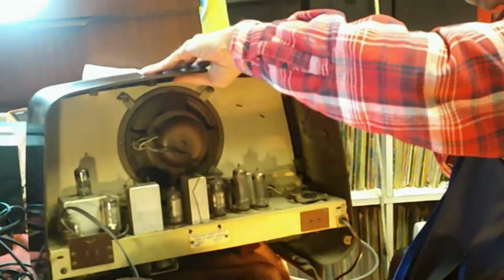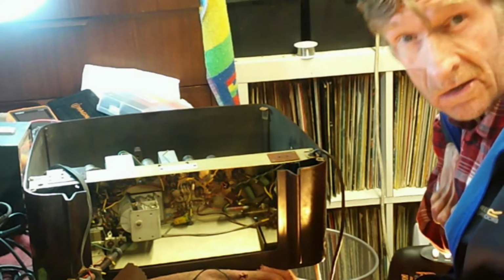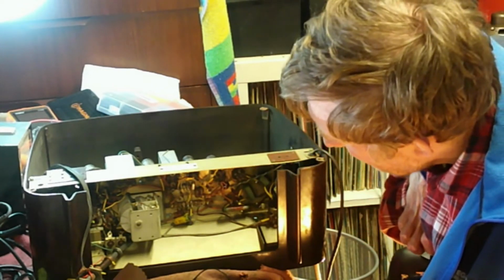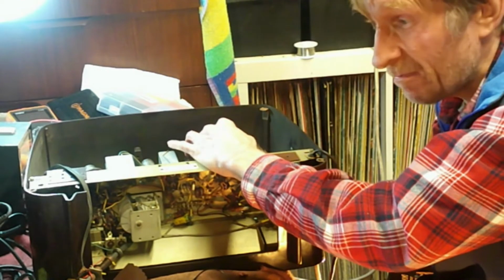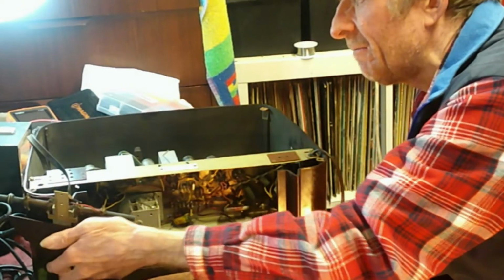Now, underneath on sets of this era, it goes like that. Can you see that? There you can. There is a brand of capacitor called Hunt's capacitors. These you replace on site. One in particular has to be sorted out very, very quickly indeed, or else you could kill the output pentode. UL84s are, generally speaking, very tolerant valves, but not all of them, so that's something else you have to look for.